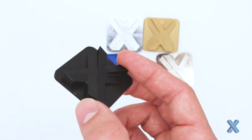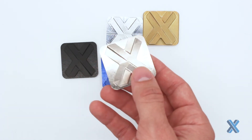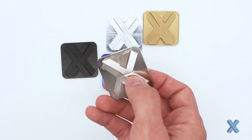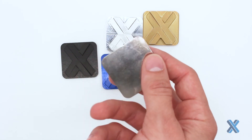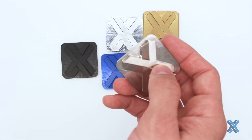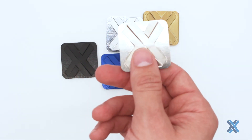Talking about nickel plate — let's go to the other side. I want a conductive outer surface but I want something that's super ruggedized. Nickel plate is awesome. This is actually a surface coating of material that is not the base material — I start with aluminum and put it in a bath that attracts nickel alloy to it, so now I have a very tough outer skin on the part. It has a nice increased shine. Nickel plating is great to maintain a conductive surface while having lifetime wearability — extremely durable. A lot of casted parts made out of steel, which will corrode over time, are often nickel plated, giving lifetime use while using a more commoditized material.